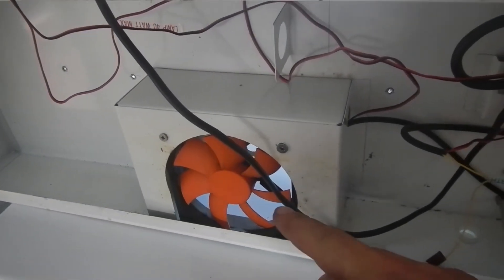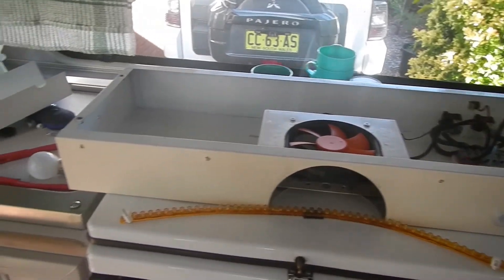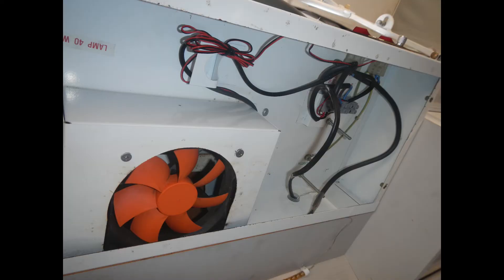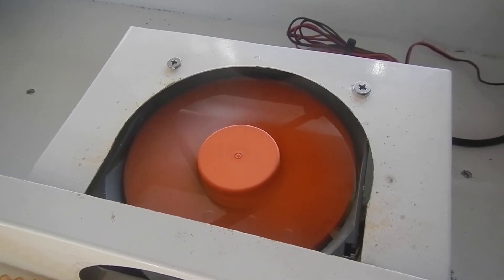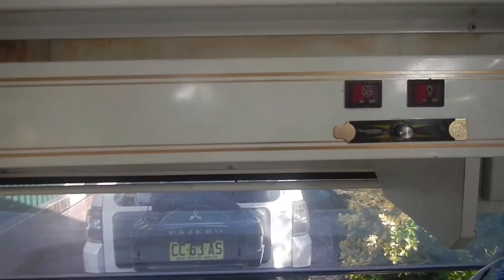We're just back in and testing the switches. I haven't put any LEDs in yet — I just want to test the fan. After some faffing about, this is the iteration I'm going to settle with for now. We've got it all wired up, tidied things up in there a bit, put a few cable ties on, because quite a few of those wires are very fine gauge. The switch on the front for the fan and the controller allows us to adjust the speed. For the 240-volt wire, I've absolutely killed it with shrink wrap — shrink wrapped it about four times and then taped it as well, so that's fully protected. I've folded it back because this is the vent here, and if we ever get water ingress, I didn't want that getting onto the 240-volt. So that's our 240-volt range hood converted over to 12-volt.